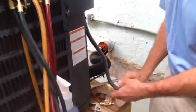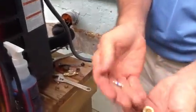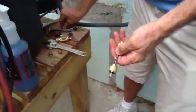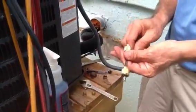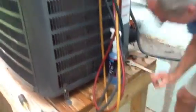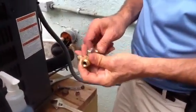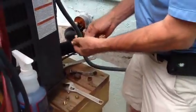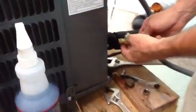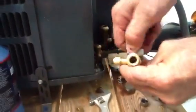So what we're going to do is I'm going to replace this valve with a brand new one. First thing you want to do — just take it and screw it on. I've got the ball valve closed. Just take your time, don't rush this. It's kind of like surgery for a doctor. You want to thumb tighten it, and then the valve is still closed.